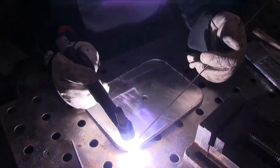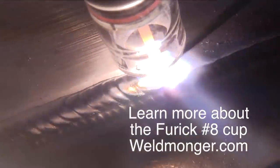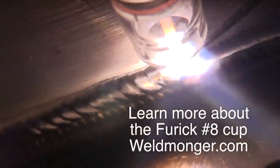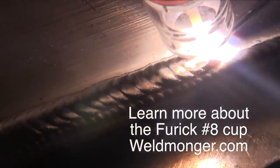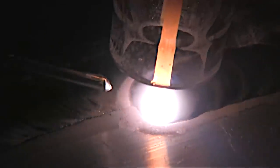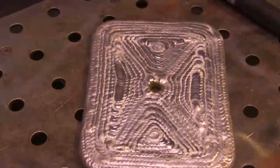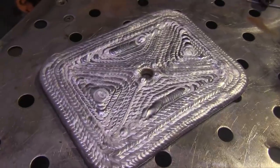I always swirl to avoid a crater crack as I taper off amperage. If you don't do that and just let off amperage suddenly, sometimes you will have a crater crack - and if it's an expansion tank or cooling reservoir, it's going to leak. Here are some shots of a sort of practice aluminum drill that I shot. That's an example of just how well this cup lights stuff up.